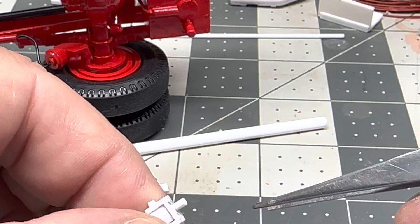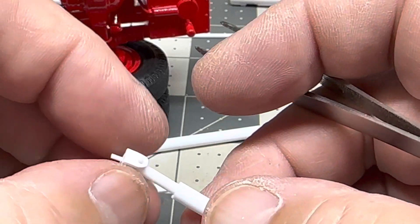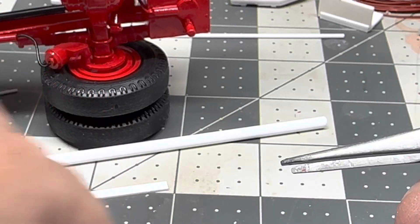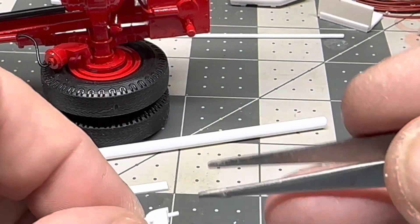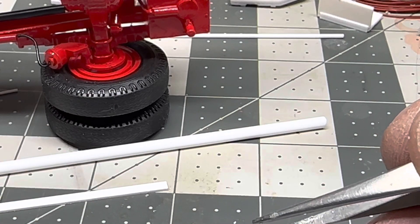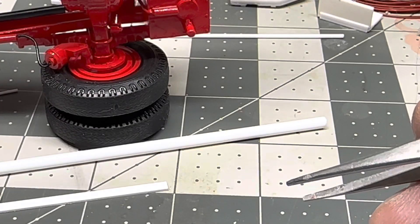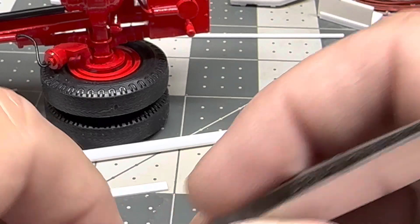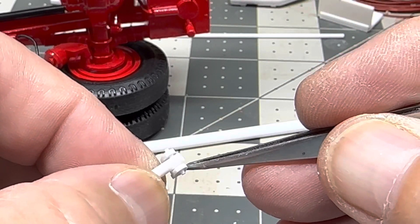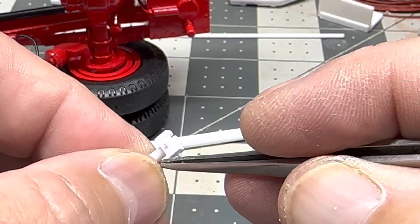For the other side, it being smaller, I used the same 40 by 125 flat stock but I drilled a 35 thousandths hole in it, because I have 35 thousandths rod — just real little bitty. Then I did the same thing: I just kind of opened up the outside edge, pressure fit that through, and made sure that I was up far enough to the end so that I could still get my movement back and forth.